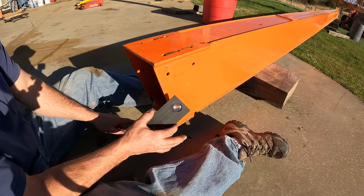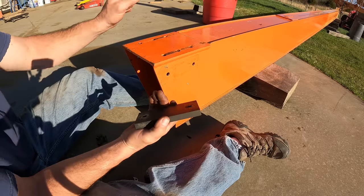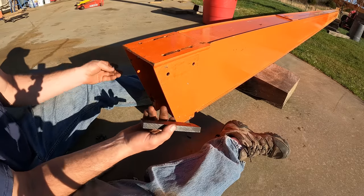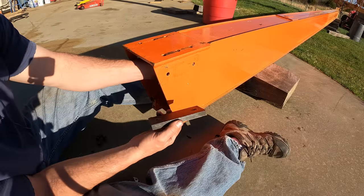We'll see what happens. So I went through all my wear pads. They're all within spec, but some have more wear on them than others. The ones on the inside, the opposite end from the basket, are inside the boom, very difficult to replace without ripping this thing apart. So I'm putting my best wear pads on the inside. The others on the outside you can replace anytime.